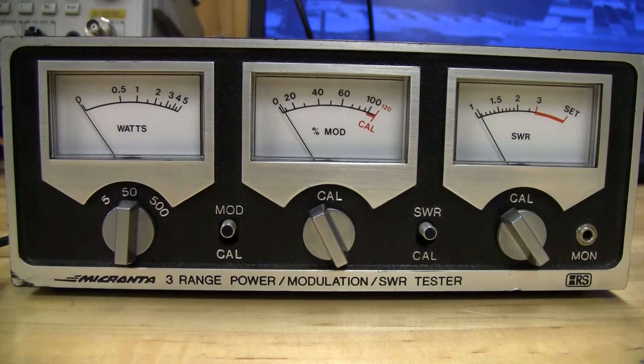The caveats to this are: if you have a more sophisticated meter, like a BIRD 43 — the well-established meter for RF measurements — it has a directional slug that can be oriented to measure either forward or reflected power and will ignore the other. So you can safely measure forward power into any load. Similarly, a more sophisticated digital meter like an MFJ could take into account the SWR and subtract that extra power standing on the line as reflected waves, calculating what the forward power actually is.